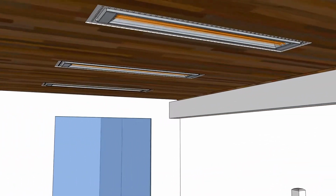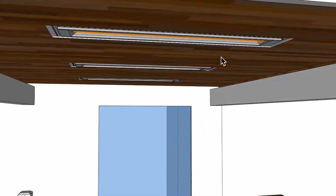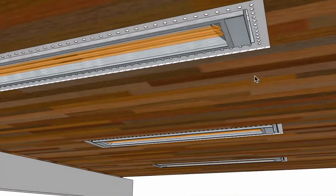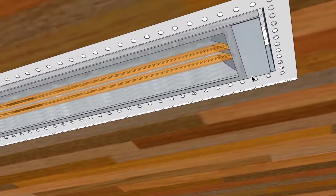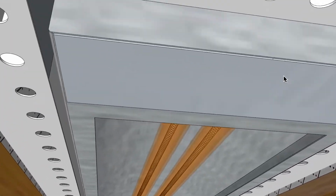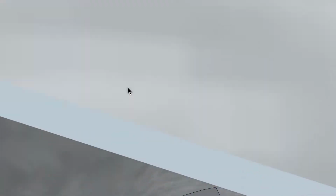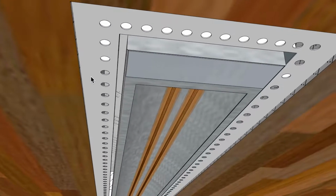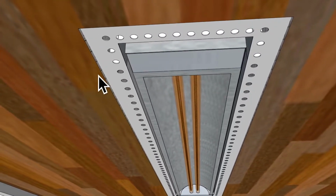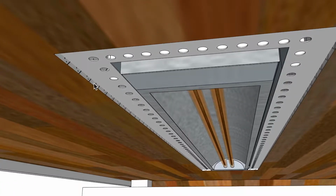I believe that they do have a tongue and groove finished roof, and what I've done here is I've placed my 1 hour rated firewall that you can see in here. Sorry about that. Inside here we have the 1 hour firewall drywall installed, and then we have the flush mount frame, and I've placed the flush mount frame behind the physical tongue and groove finish. And you can see here I have a little bit of depth.